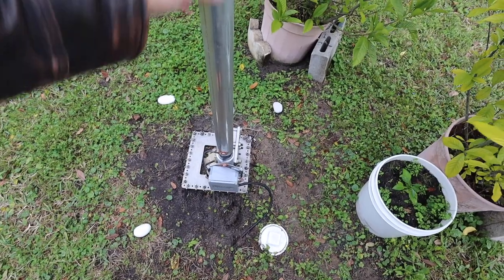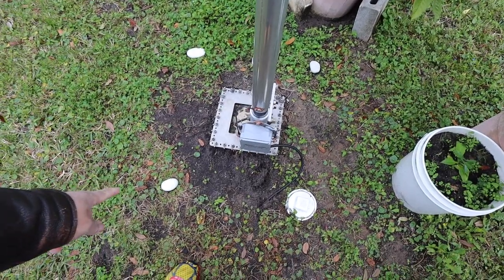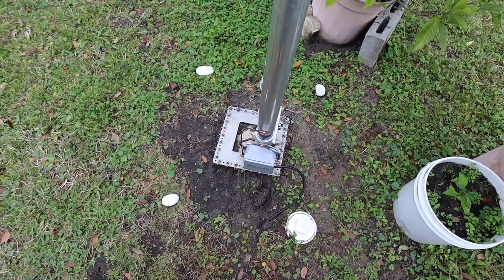Today I want to lay down three additional grounding rods. I'm going to pound them the old-fashioned way and put them in a box formation around the antenna. The element is right here in the middle, the antenna surrounded with four grounding rods.